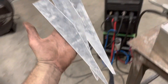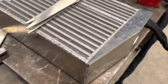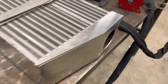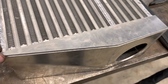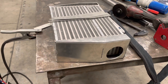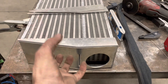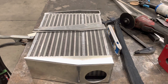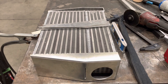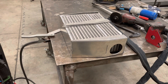We've got our front and rear caps cut out, deburred, and here she is sitting up on the actual end tank of the intercooler. Got to do a little more fitting and playing with it. I'm going to get this guy tacked up — clamp it down to the table, do one end, flip it over, clamp it back down with the other one, tack it up, spin it around and do the other side. Once I get that all squared away I'm going to try to set up a time-lapse, hopefully I have enough memory on my phone to film that out for you guys and get this guy burned in.